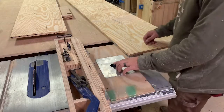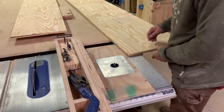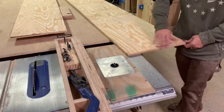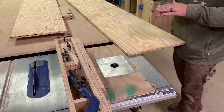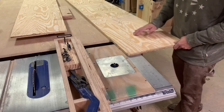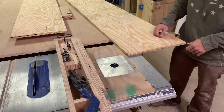I've got a little one-eighth inch round-over bit in my router and I'm going to round over the top piece — both the underside and top side — just to knock off any splinters. The rest of it I'm not going to do any routing on because it's all going to be a butt connection. Maybe the front side of the bottom I'll put a round-over on it.